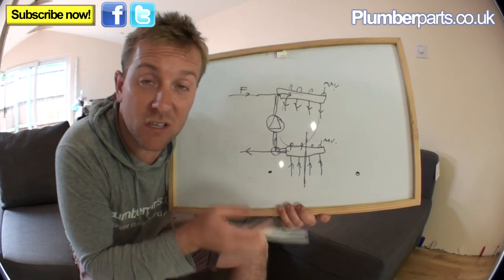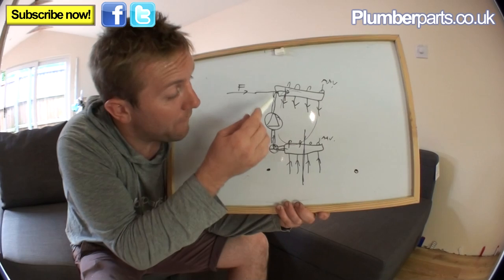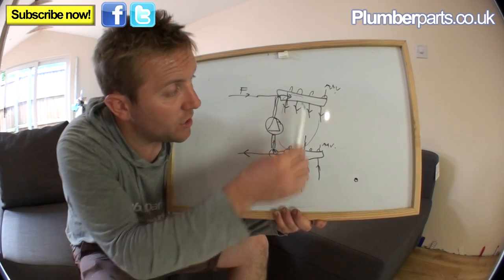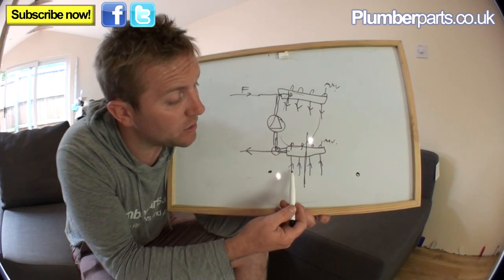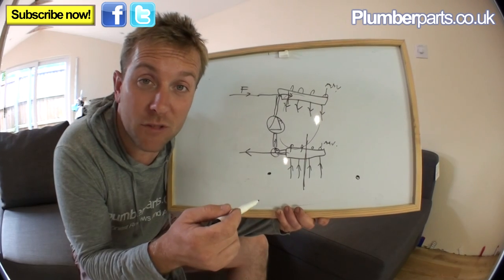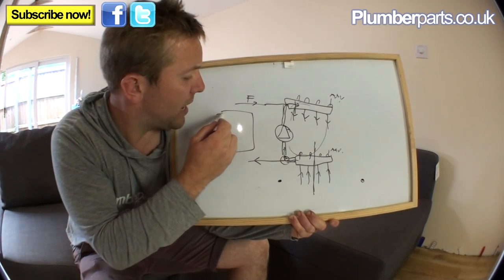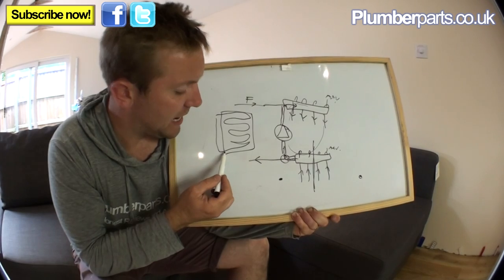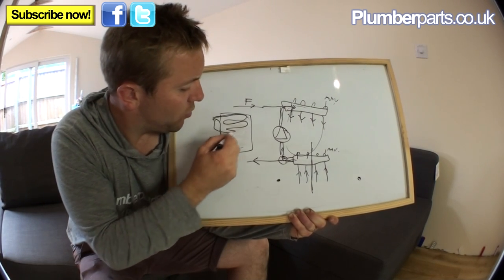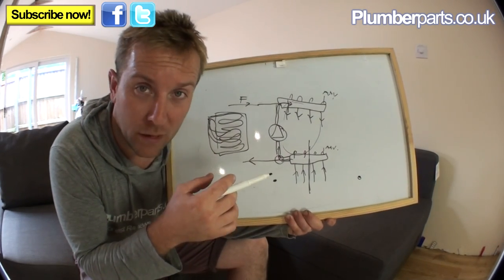Balancing knobs at the top work just like balancing a heating system. If all loops were open and demanding, your flow would come in and is more likely to go down the first port and loop and back again. You'll often come across a small domestic property where a manifold is just a couple of zones, but that doesn't mean four pipes means four rooms. A room can be so large that you need different loops to distribute an even temperature. For example, in a big room if you just had one coil going round it, by the time it got to the far end it'd be freezing cold. So you have one coil going round and back, then another coil going round and back, then another - meaning the floor heats up a lot more evenly and a lot quicker.